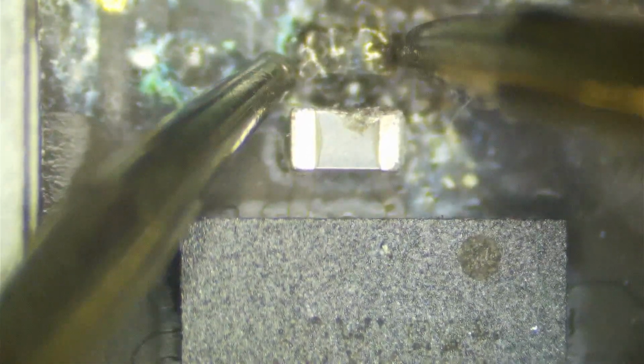And how do I know it's a 0 ohm resistor? Well, technically I don't, but it was a 0 ohm resistor on the previous model's backlight circuit, which uses the exact same driver. And this is 386 ohms. 386 ohms is not 0 ohms, so chances are what is going on is that chip can work. The resistor is going to let voltage through. The resistor is just going to restrict current.